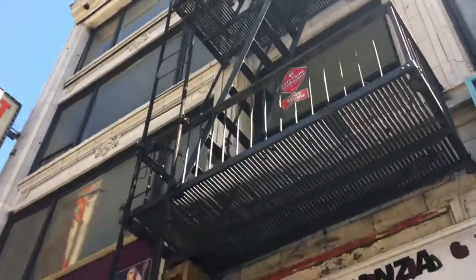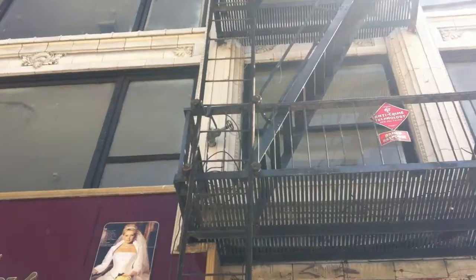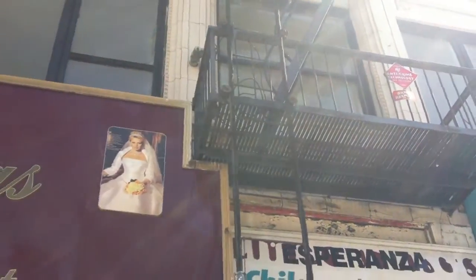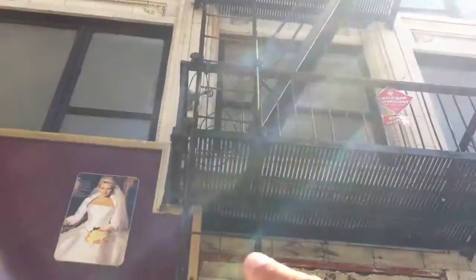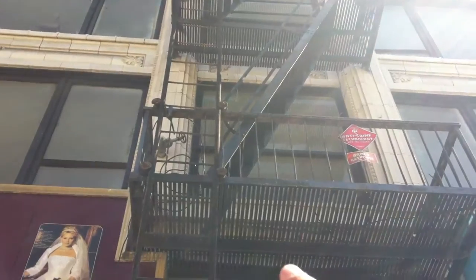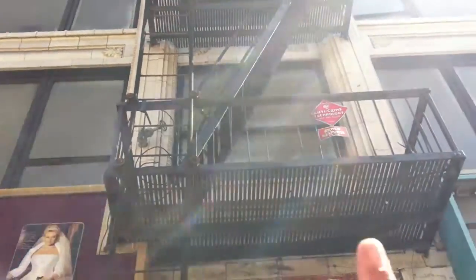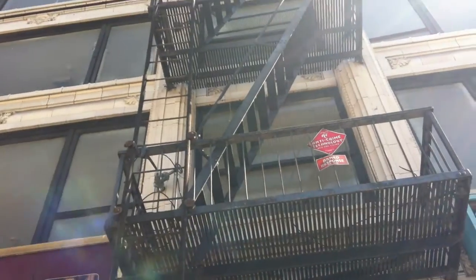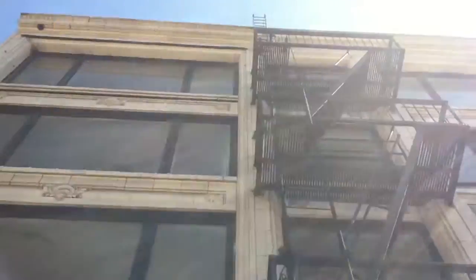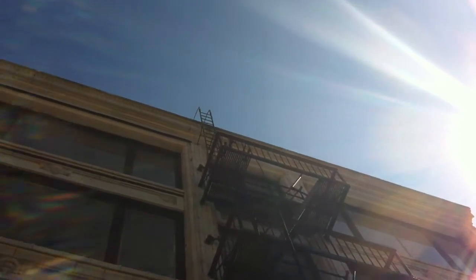This fire escape is showing no evidence of maintenance anywhere — only a paint job over a 50 to 75 year life. It's impossible for a fire escape that old not to have some evidence of maintenance. In 25 to 50 years, you'd expect the rivets on the support staircase to have been changed or reinforced, the platform support structure to have been done, the corner rail posts replaced, and the stringer clips at the top and bottom redone. The gooseneck at the top, mainly for the firemen, shows nothing but original square head bolts — those need to be verified and confirmed.